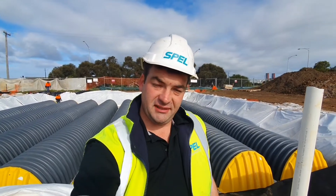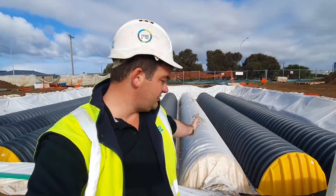The inlet into this system comes through a pump well which has an extended sump underneath it, which doubles as a knockout for the sediment. Coming into the system, you can see behind me on this inlet row there's a 600mm diameter pipe, and that allows for future access if needed, but mainly for maintenance and cleaning ability.